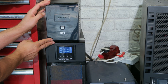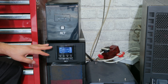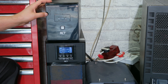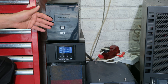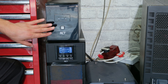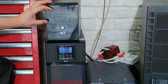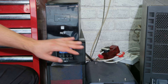Over here I have an offline UPS, and the whole video was about online UPSs. The online UPSs are the ones that clean the power. This offline UPS only comes online when the power dips - when Eskom power goes offline due to load shedding or a power outage. This particular unit does not offer any type of power cleaning. What I said about online UPSs applies only to those units. These unfortunately do not offer any refinement of the power; they simply kick in once the power has gone off - they act almost like an inverter.